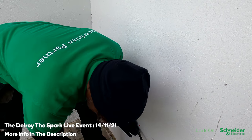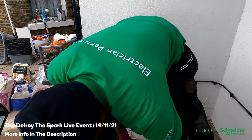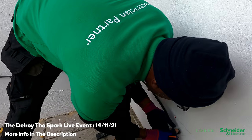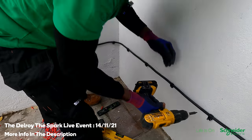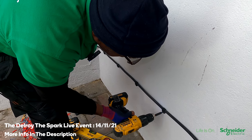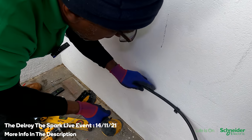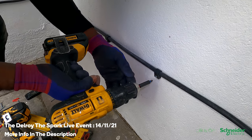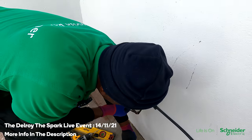I'm putting the cleats on and then starting them off with my screwdriver to make sure they're in the raw plug properly, then using the battery drill to screw them in. You've got to be careful — I'll just have it on slow. If you have too much power on it, you can push it right through and it won't be holding anything, then you have to redo it.